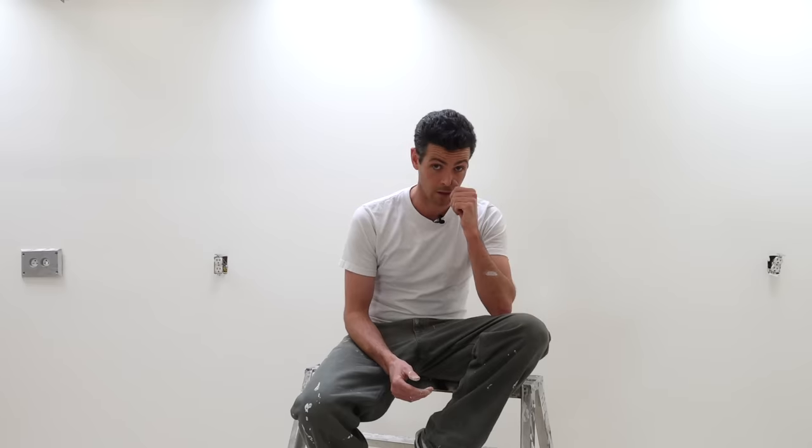So it may not last 10, 20 years, but I think this place is only going to exist for like 5 years at the most. So it's more than adequate. I think I would have needed to straighten out the corners with actual framing, going back to the actual framing and shimming stuff out. And that would have been even more work. Instead of the 6 inches that I went back, I would have had to go back at least a foot to be able to shim all that stuff out. So that would have been too much work.